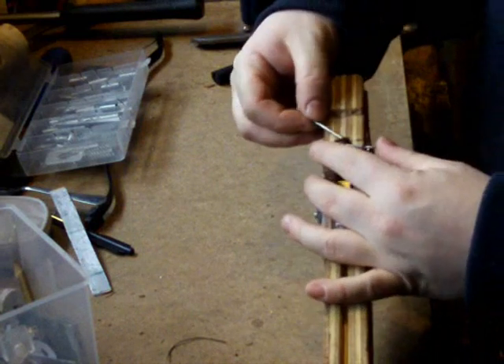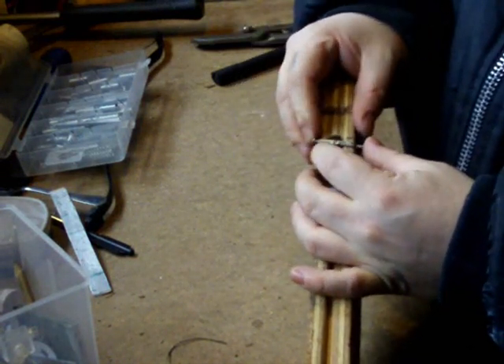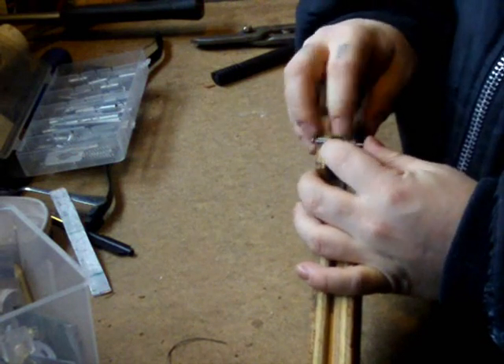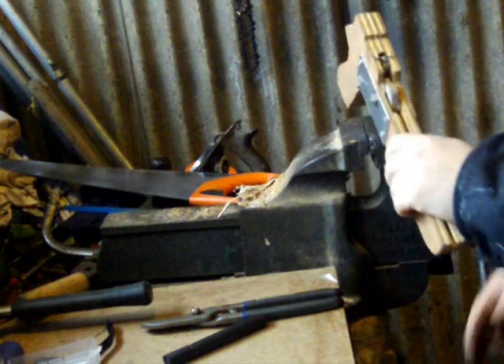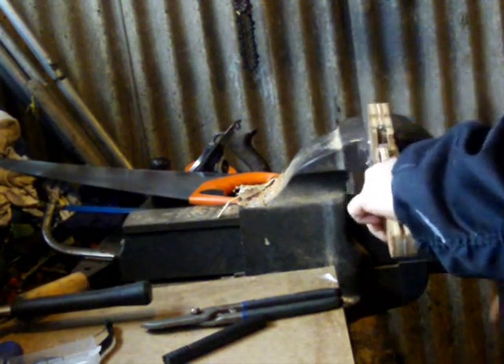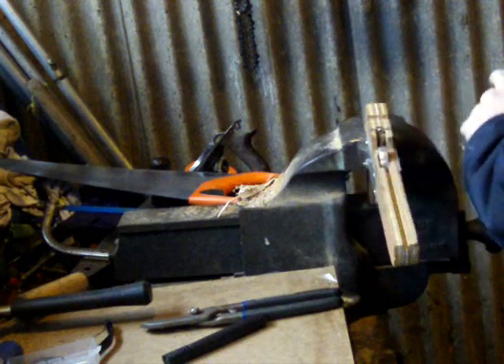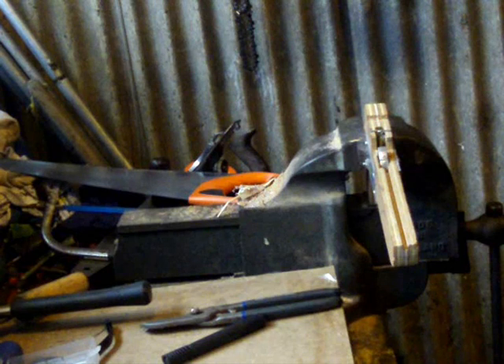There's your little pin for the spring. Just place this one through where the other one was, so it's in place, then remove the other one. Now get your crossbow stock and put it in a vice or whatever you've got. I'm just going to cut in a little groove for that pin to sit in.